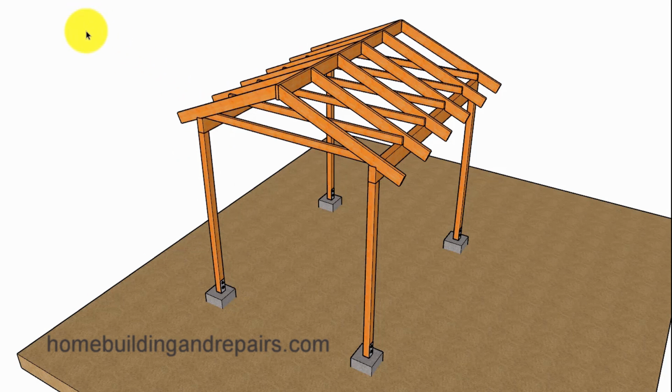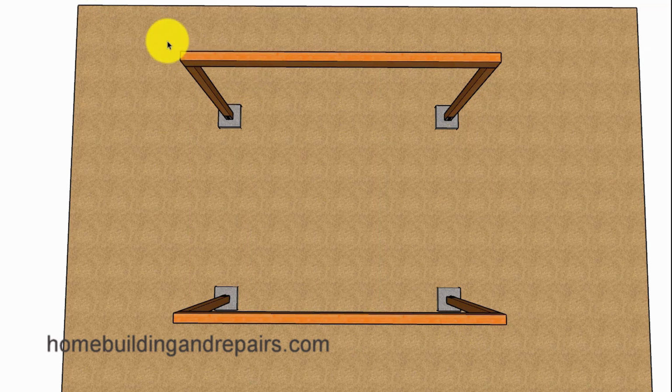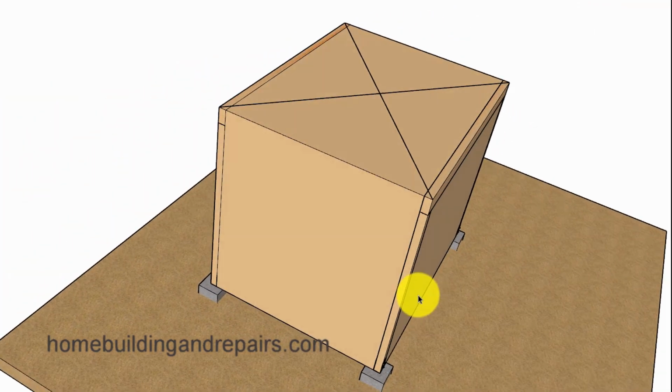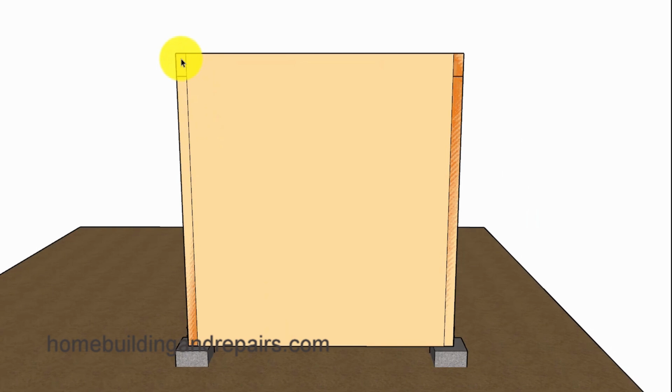And since it was a project that I was doing after work and only had a few hours to do it, I didn't measure both sides of the beams. I only measured one side and assumed the other side was going to be the same, like it is most of the time. And of course, that's what we're looking at here in this first example. All of the ceiling joists are the same, the beams, the roof rafters are all cut the same. And of course, the measurements from here to here and from here to here, to where we square up a building, should be the same also. So this would be a vertically plumb building where all four sides are level, plumb, and square.